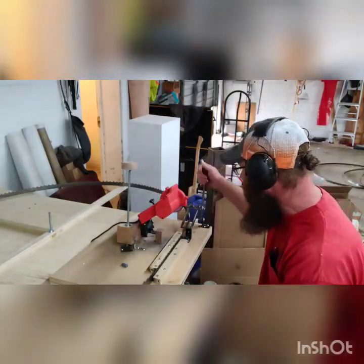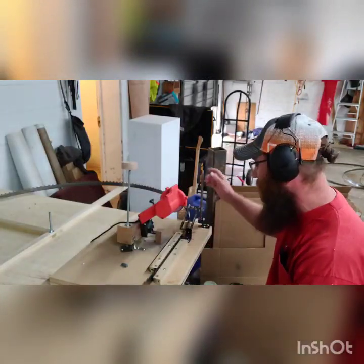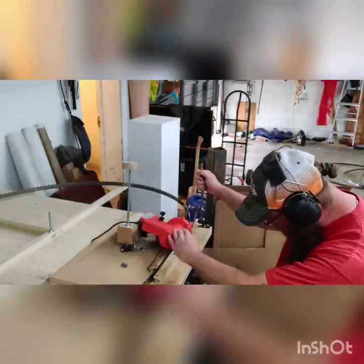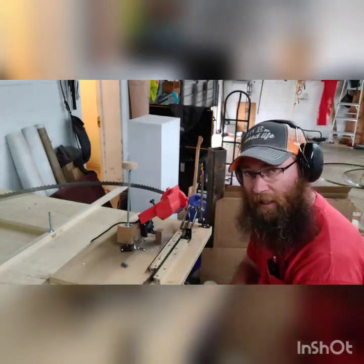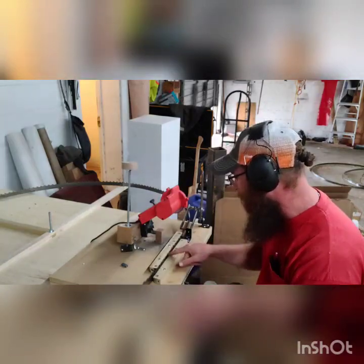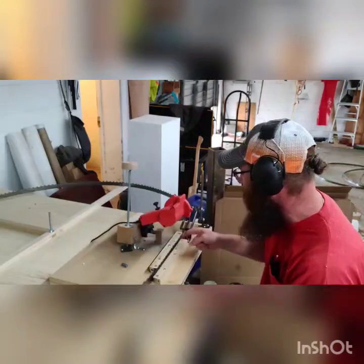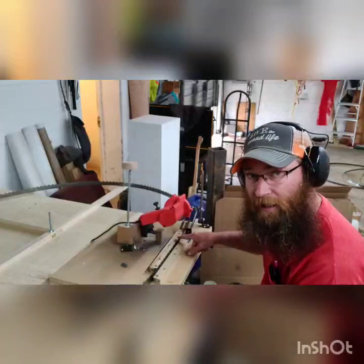So the advancing arm comes down, it contacts that flange nut, it stops, so it's a positive stop, and then the motor comes down, kisses the front of that tooth, and then I move on to the next one. Now I'm at a debate with myself on this as to whether or not to bring this down, hold it in place, and then advance another tooth so that this acts as a drag grinder and hits the gullet and the back of the next tooth.